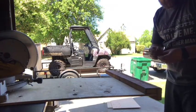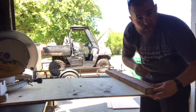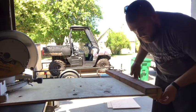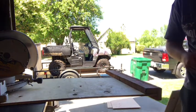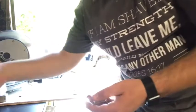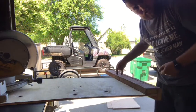So, now the thing with this whole combination is the 2-inch screws that I was talking about earlier. If you line them up here like so, perfectly, they are the perfect length, as long as you do not, using your impact drill, drive them in too far. So, for the sake of the strength and integrity of this side, I'm going to screw from the bottom up. I'm also not going to pre-drill my holes, for reasons I do not know. But I am going to do 6 screws each leg on each side. So basically it'll be 2, 4, 6, but from underneath.